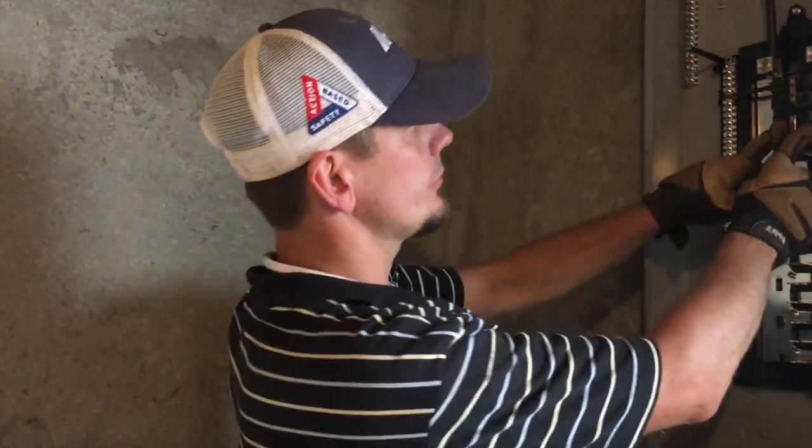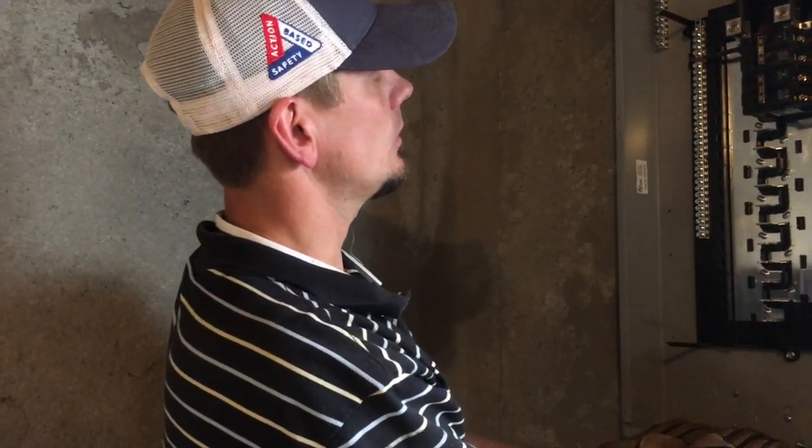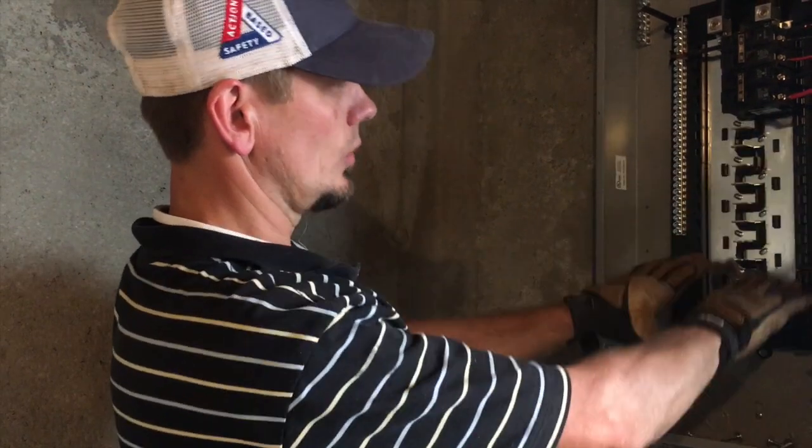In this scenario, because we are hitting the garage at 50 amps, we went ahead and breakered it here at 50 — that's the garage. The dryer is being fed, and this panel is fed at 100 amps to this bus bar.